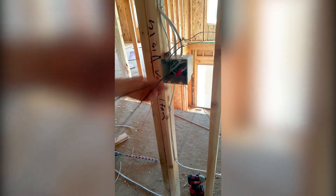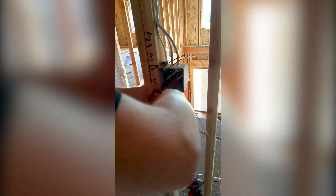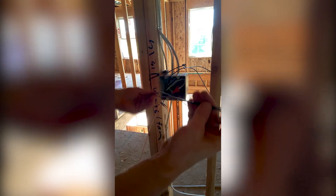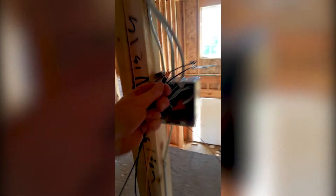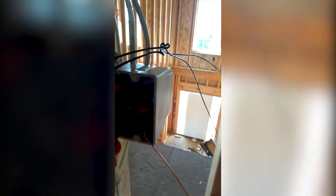Then you move on to your feeds — your black wires, the ones that aren't signified by switch legs. Back left-hand corner of the box, just like your neutrals. Cut them off. You've got two switches, you need two feeds — two single wires that give you your feed for each switch. Make sure they're nice and even. Red wire nut, get them nice and tight. When you tighten down the wire nuts, tighten them until it starts curling the wire so you know it's nice and tight. To the box, in the box — notice that brings your feeds out in the center.